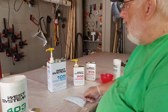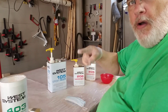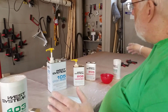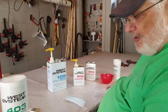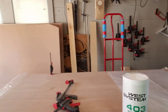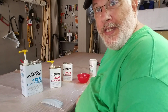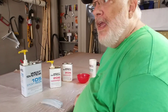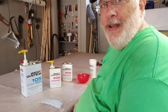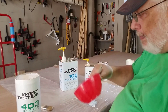So today I'm going to do several scarfs. I've got to connect this 8-foot piece of wood to another 8-foot piece over there and a 4-foot piece here, so this is going to be about 20 feet long. Underneath I've got two 8-foot pieces I scarfed yesterday, and I'm going to connect a 4-foot piece. I scarfed all morning long with my scarfing jig — if you want to see how I made the scarfing jig, I'll have it clickable at the end of the video. It works really slick; the hardest part is building the jig, which takes a couple of hours.